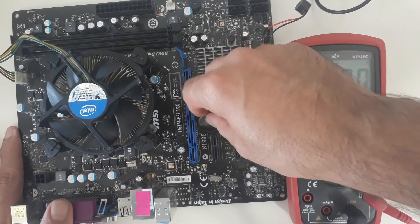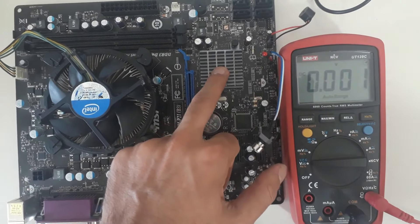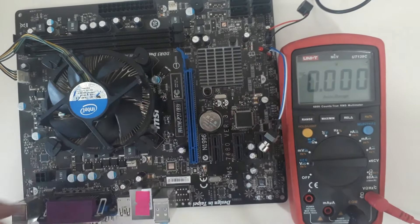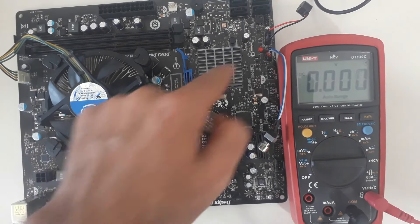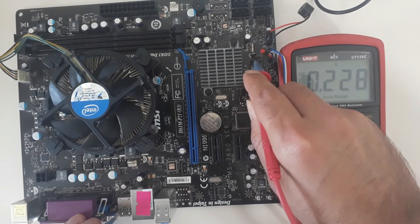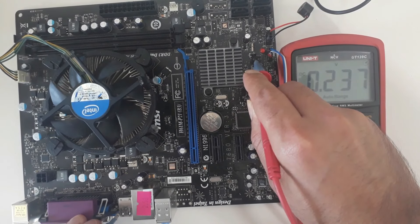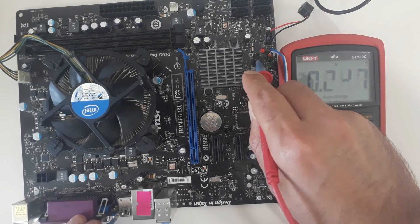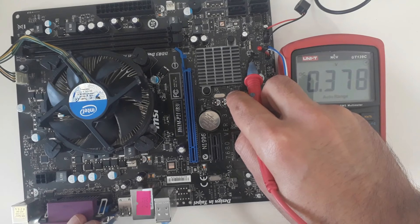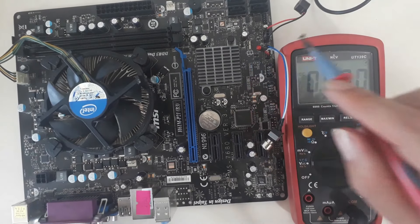I place the battery back. The battery provides voltage to a part of the PCH as well as voltage to the crystal. Let me show the voltages on the pins of this crystal: around 230mV is present on one pin and 377mV on the other pin. This shows that voltage is present on the crystal.